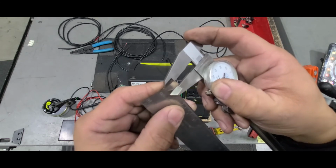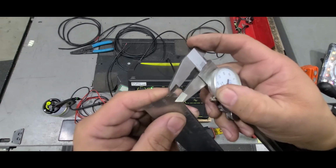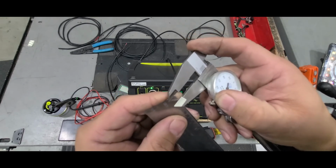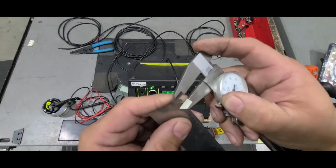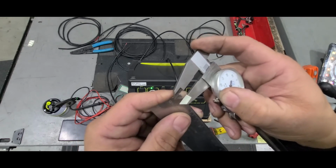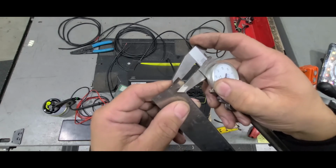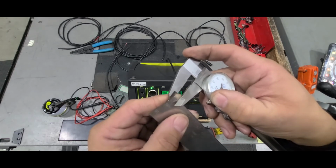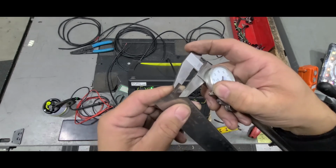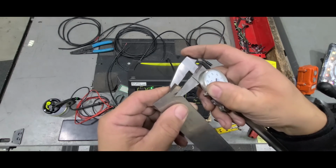So on the internet, if you go to Amazon or all these places, they're going to say 5.5, and they're going to say 6, but if you look at the specs, it's 5.5. That's a roll of the dice if you want to pick them up like that. They may not fit. You might have a bad connection, and if you do have a bad connection because it's not right, that's when you're going to probably get into heating issues or arcing, and it may cause problems.